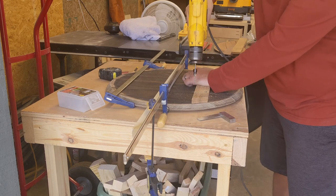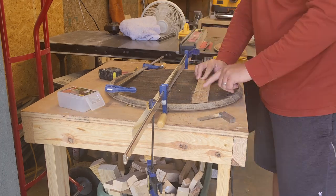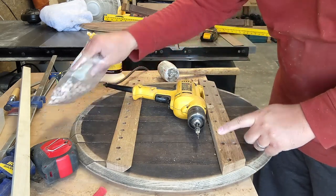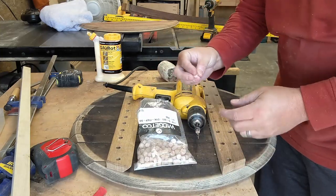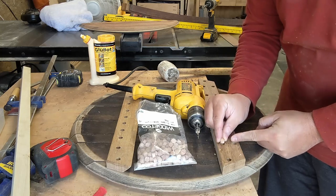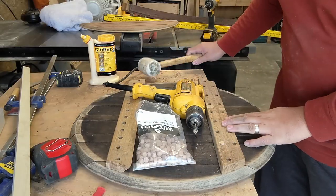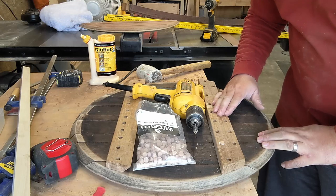I'll line this up where I'd like it and start with a couple of holes, getting a couple of screws in to hold the piece in place before drilling the next set. When I countersunk these holes I used a 3/8 inch countersink drill bit — a little bigger than needed — because I'm going to fill all of these with an oak dowel. I'll put a little glue in the hole, line up the wood grain with the rest, poke in the dowel, give it a couple of taps with a non-marring rubber hammer, and after it dries I'll come back with a belt sander and sand these all down.